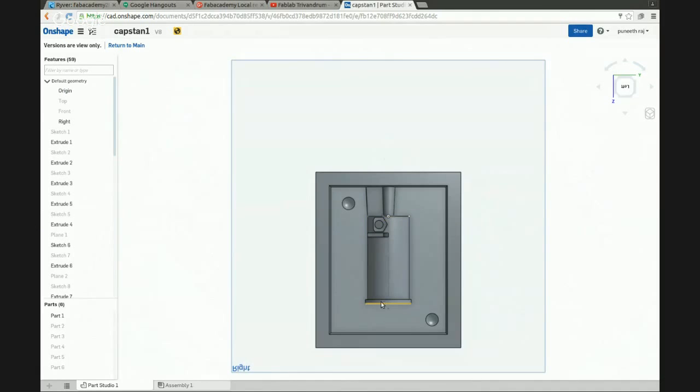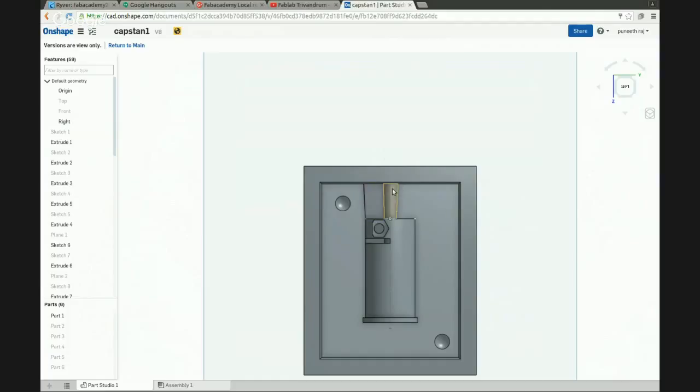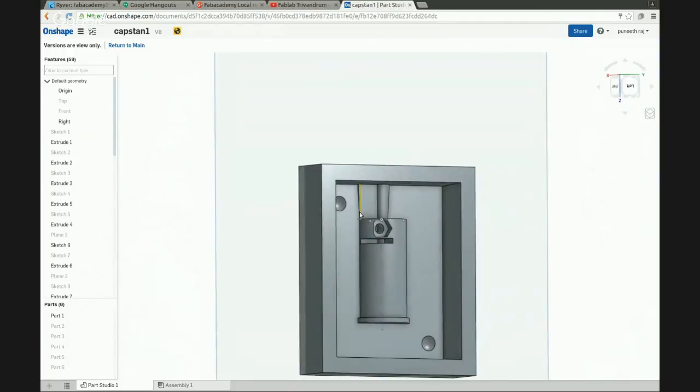Yeah, so in this orientation, when they are compressed, you are not going to be able to put in anything else. But this hole is pretty large. So if I start pouring from here, the air can start escaping from this feature. So the hole will be of this shape, this thing and this thing. So that big a hole. So when I start pouring from this particular vent, the air can escape from this part.